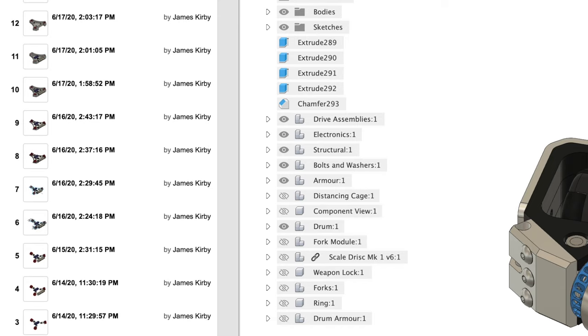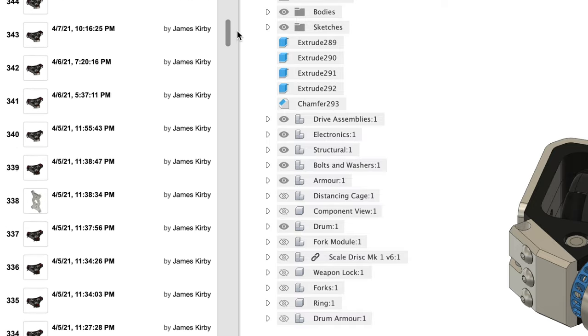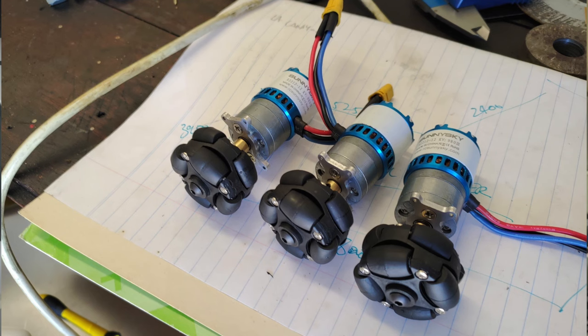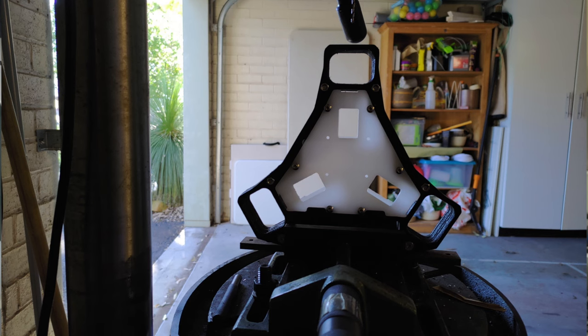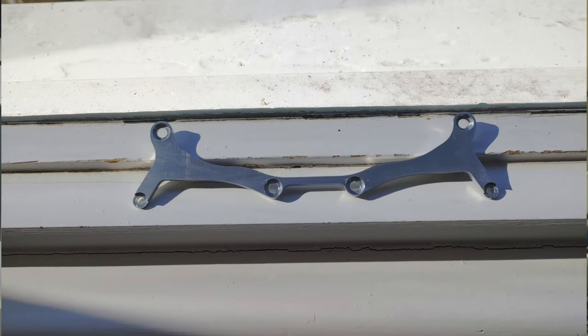I spent a good 6 months or so continually tweaking the CAD, as there was plenty of time during the pandemic. After just a few versions, it was good enough to start manufacturing. Some parts I could make myself, such as the gear motors and the chassis bits, but others I had made by a local machinist, including the drum, axle, and all the aluminium parts. As I was still in school and had access to the TAFE areas, I bent the aluminium panels with the magna bender and tried to polish the chatter off the HDPE with a buffing wheel.